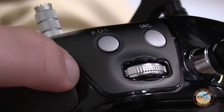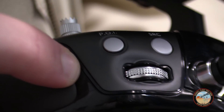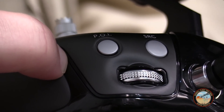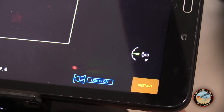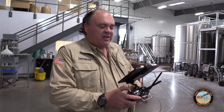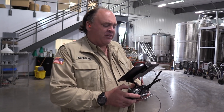There's a Point of Interest button on the controller, which allows you to highlight a particular moment in the video so you can easily pull it up when watching later in Flyability's software. The Elios has bright lights on board which you can control the intensity of, and you've also got a lot of control over the gain or the brightness of the video. You need to learn how to control both of these things to capture clear images of the asset you're inspecting. It takes real practice.